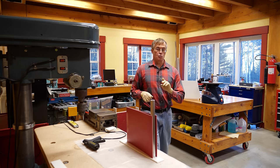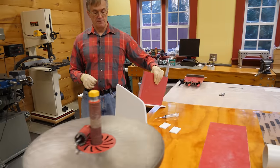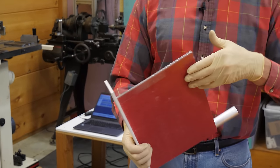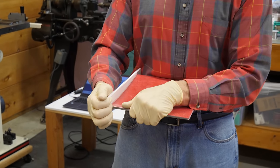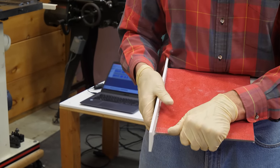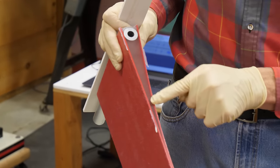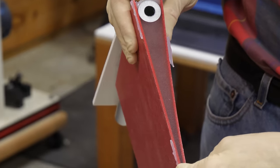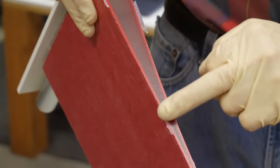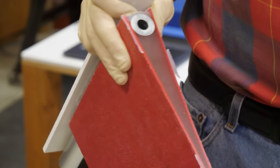Let me show you over here what happens when I did this yesterday and let it harden up. I have another example of the same setup, sealed along here and filled up with epoxy. This stuff does break away pretty easily. And as you can see, you get an excellent surface — this is easily removed with just a razor blade because it's just hot glue. And a little bit of sanding, or you could almost paint this at this point because it's almost mirror flat.